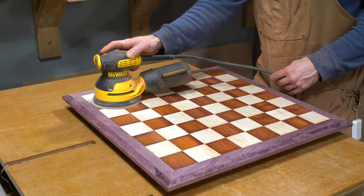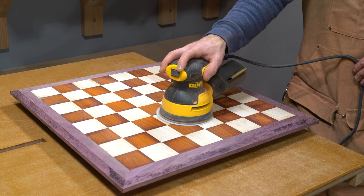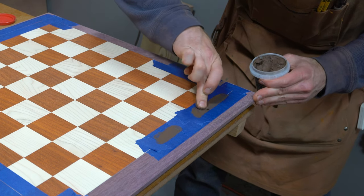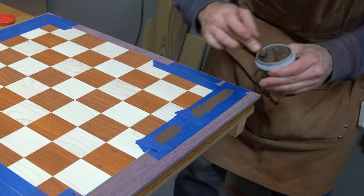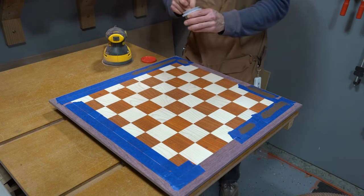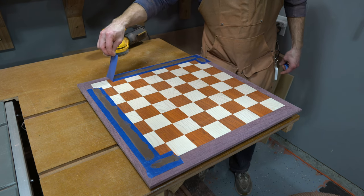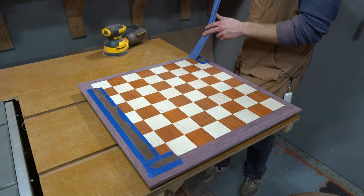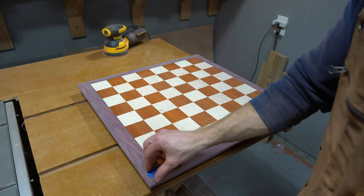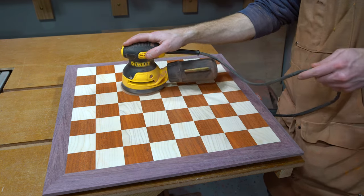The key to a great finish and to maintain a flat top surface is to sand patiently and let the sandpaper do the work as you glide it across the surface from top to bottom. Once I've sanded from 40 grit to 320 grit, I will place painter's tape on the outside of wherever any small gaps are, even if they're barely noticeable. The painter's tape prevents the wood filler from seeping into surrounding wood fibers and means there's no extra dried filler to sand afterwards. I noticed that walnut wood filler matched the Purple Heart closely enough. Before the wood filler completely dries, I carefully remove the painter's tape, leaving behind only the filler that filled the hairline cracks.